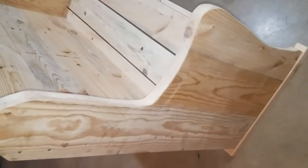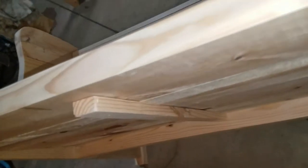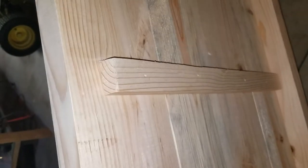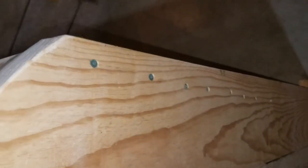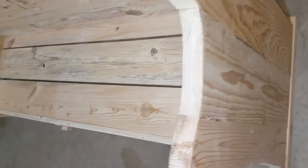This is not too bad to build. The back benches with a straight back are incredibly uncomfortable — I've always thought so. I put a five-degree bevel on the bottom board down here and just kind of kept going with that line. You can see the slant on that. I put that little brace in there just to kind of hold it together. I'll putty those screws. Like I said, the end panel was the key part.